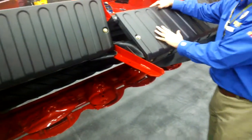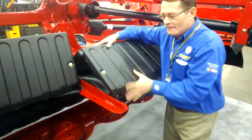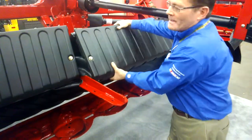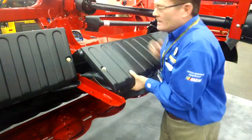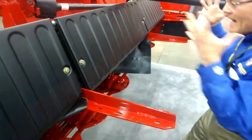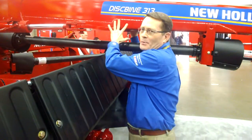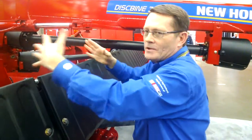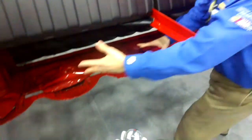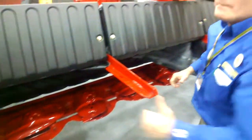The bifolding doors are made out of a heavy-duty composite material so they won't get dented. If you're out in a field that has obstructions in it, the bifolding door — because of the way the hinges are on it — will allow an operator to move the doors back and get to the cutter bar regardless of the position of the tongue. That means no matter how the tongue is positioned and no matter which knife assembly you need to get to, you have access to the entire cutter bar area.